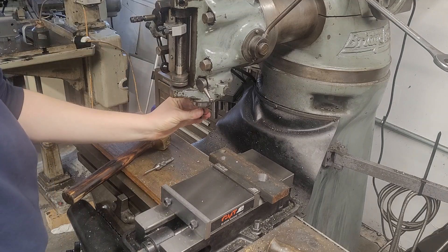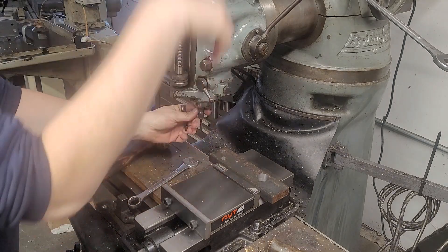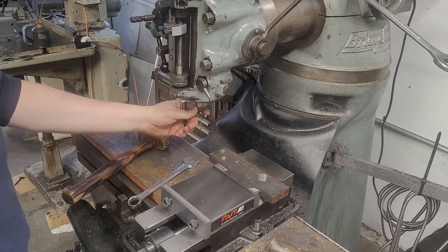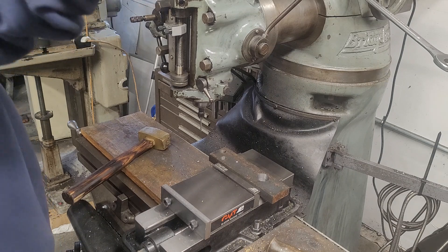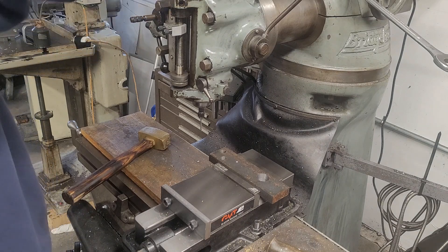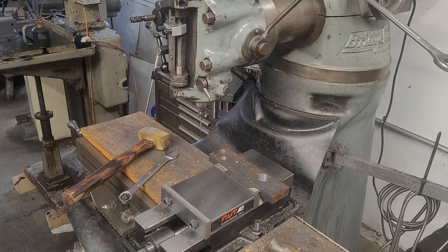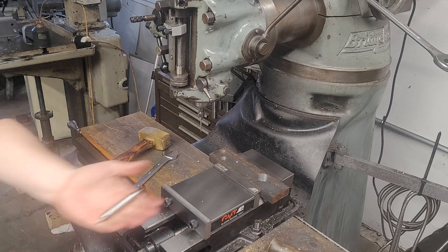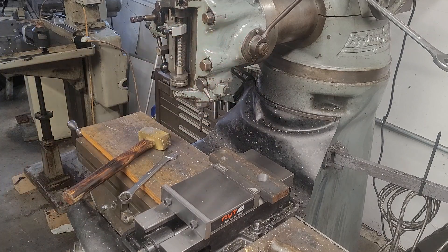The wiggler is nice because I use a lot of 3/8 inch end mills and it will fit perfectly in a 3/8 inch collet. It really depends what I'm doing. If I'm drilling, I tend to use my Starrett as an edge finder. I have a Mitutoyo, which is a different style of edge finder — a cylinder type. I find those to be a little bit more accurate, but the Starrett is plenty accurate.